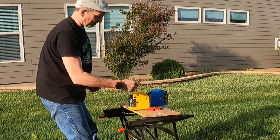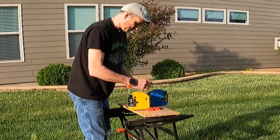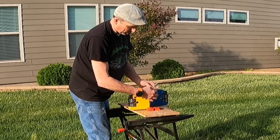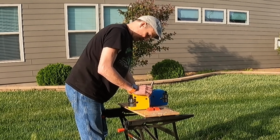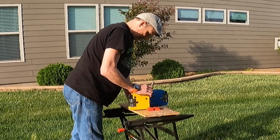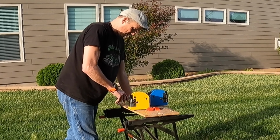Now the handles, they don't fit in here yet. I've got to get rid of the bumps on the edges of this, then they'll fit in. But once these go in, I'll be welding a tab on the back side of this handle underneath here for the actuator rod to go down to the foot pedals. That said, I have to have room for this to go by, so I pretty much need to get rid of all this steel over here and here.